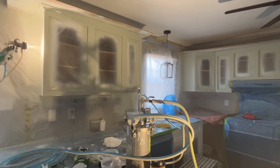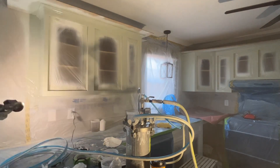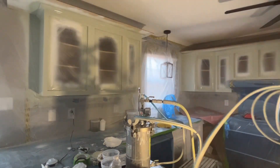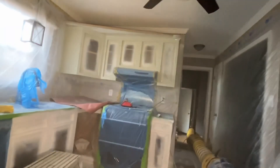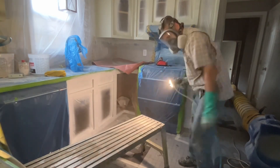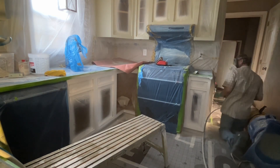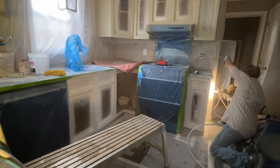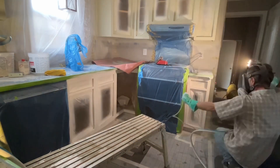I have this hooked up to compressed air and a pressure pot, and it sprayed really nice. I reduced this 5% with water, and I would say it may not always be necessary depending on your humidity and the temperature of your fluid. It's end of October and the weather was really nice and warm today, so the paint was fairly warm and I didn't have to reduce it much. I've previously tried spraying this reduced 10 to 15% before it would spray nicely with the Apollo. I do know this works really well with the pressure pot and an air compressor.